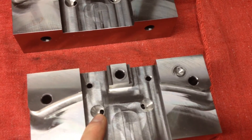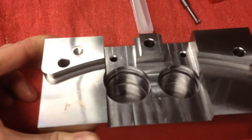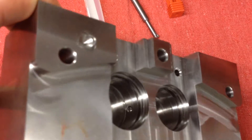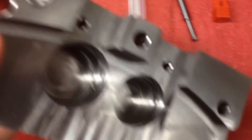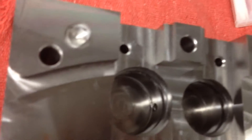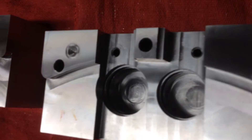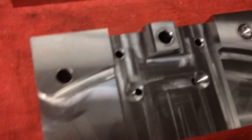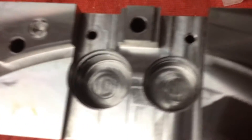Here is one part after I've done the angled holes. Next, I'm putting in the bore for the pistons, and there are a couple of O-ring grooves in there. Hopefully you can see the hole down here at the bottom — those are the two holes I drilled, which are going to allow the fluid to go from one piston to the next.